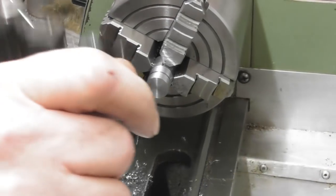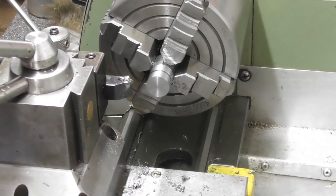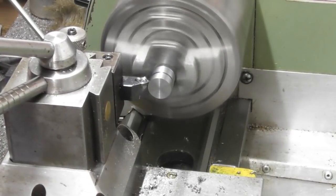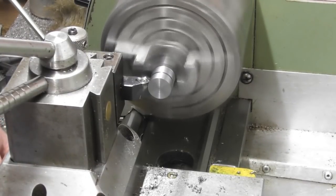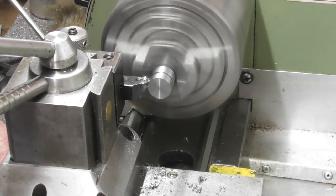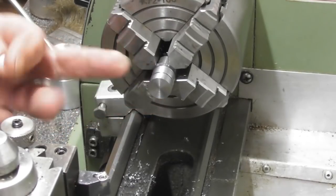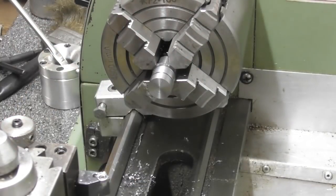I'll do a tiny little scratch with a chamfering tool. I'm going to take the chamfering tool into the groove without touching anything, without hitting the base. I'm just going to walk it left and right, just taking the corners off. Feels better already — I can't even see that burr but I know it's there. Okay, next thing to do is offset it, so we need to get the clock out. The offset we're looking for is 94 thou.